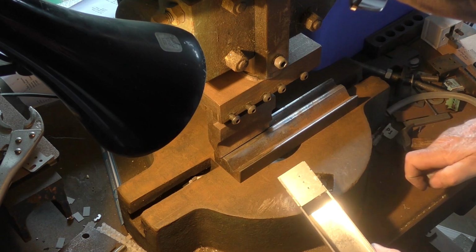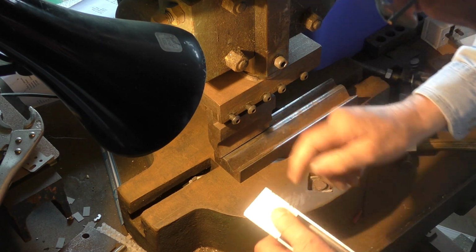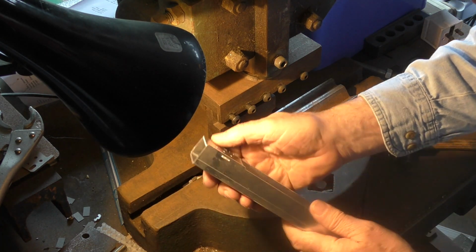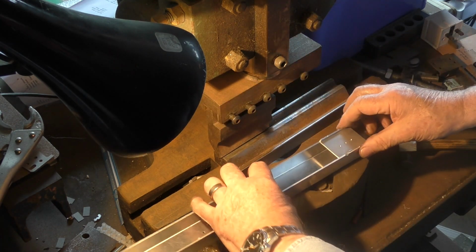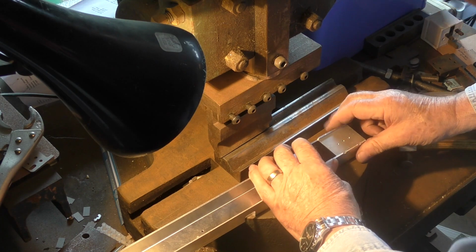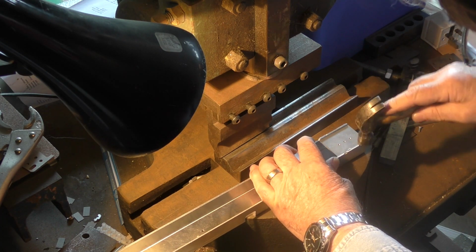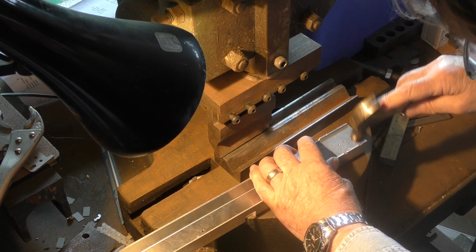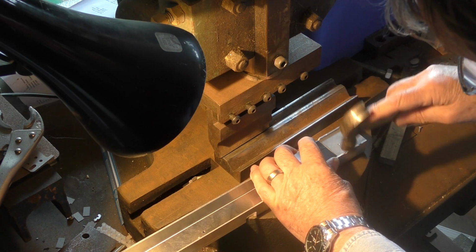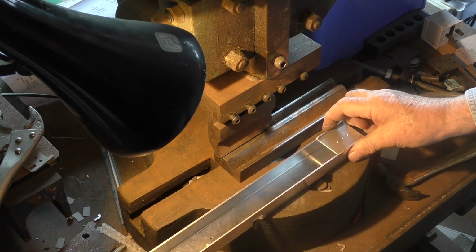And then if they've bent these pieces right, those tongues should push into that side there. Now you'll find that there are little pointy bits left on the side here. Well, they're purposely left on the side there so that you can get a hammer and flatten them. They effectively become little rivets. And that plate is now secure in there.